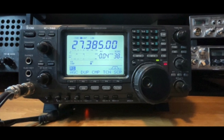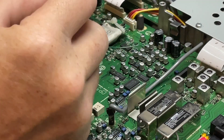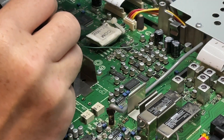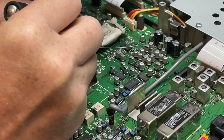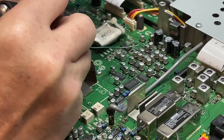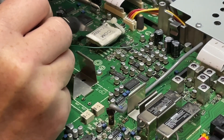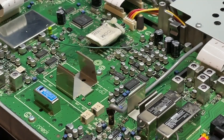I looked up online and found I've got to get rid of one resistor, which unfortunately is a surface mount component — it is small. So we'll get this opened up and see if we can make a successful job of this. This is the tricky bit. I've got to get that resistor off the board. We'll just put a little bit of pressure on the side of the resistor with the scalpel, and then just dab in with that really fine-nose soldering iron — just a couple of little touches. There we go — it's off. And it looks pretty clean, which is good.